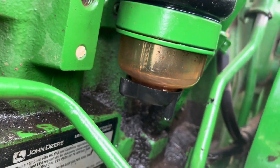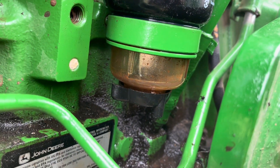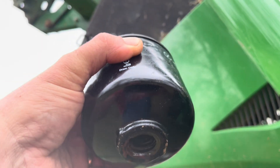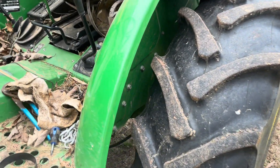There's a little fitting — you can put a hose on there and give it a quarter turn or something and it will drain into a pan. Anyway, that water separator is threaded into the bottom of this filter. There's a little ring that goes in there that keeps it all in one piece.